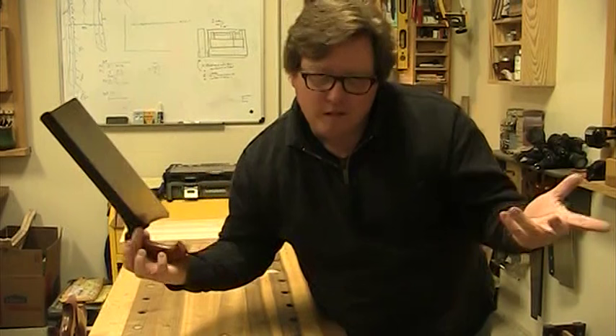Then put these three boards back together. It doesn't really matter if the length is a little off. Put your knife in that knife line with the flat portion and bevel going the same way, and just make a nick. Do the same thing on the other side. Now you have a nick mark, and you need to mark the front and the back all the way around. The bottom piece you're now done with.